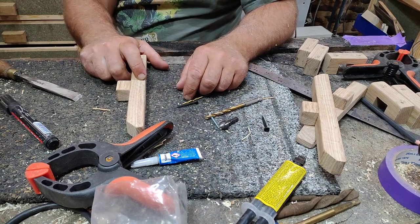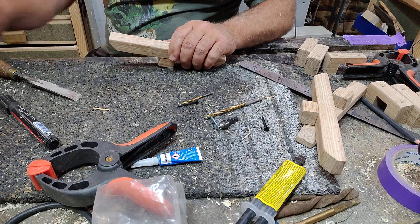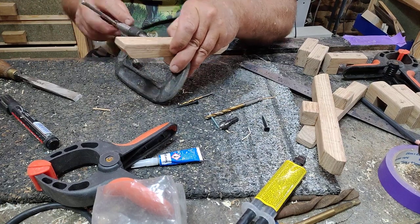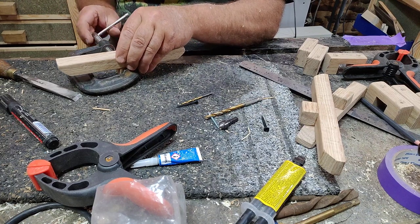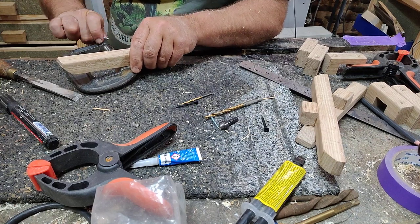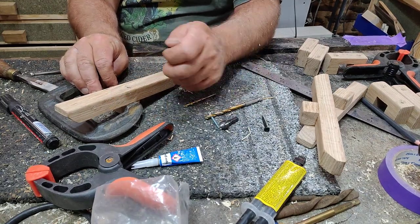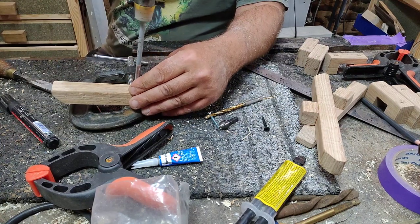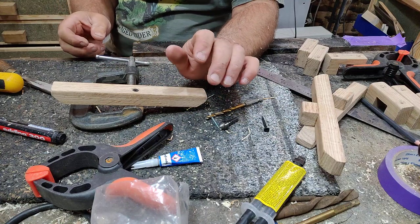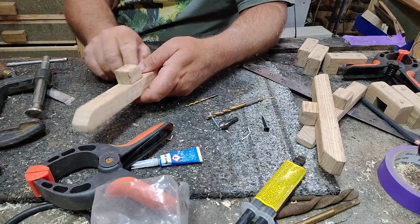What is the trick? It's so silly simple. Grab your piece of wood and you can shove it in your vise, or you could use a g-clamp. I'll do it with the g-clamp first. What the clamp is doing is putting sideways pressure across the grain so it cannot split. When you put your screw in, instead of pushing the wood apart, it's forcing the screw to cut its thread into the little piece of wood. Place the screw in there — done. Has it split the piece of wood? No, it has not.